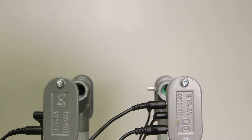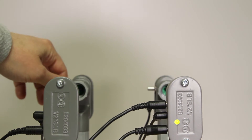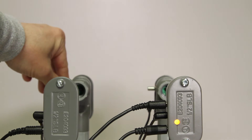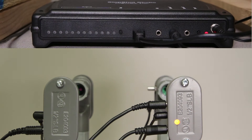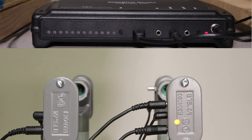Now that we've got those settings in, the first thing we're going to do is turn the transmit power level all the way up. You'll see the light turn green on A, and it's going to turn orange — which is hard to see on camera — but transmit power is all the way up. Now as we swipe our finger through the A sensor, you'll see output 2 come on. And if I swipe it through B, you get the B sensor to come on. And if I swipe it through both, you see A sensor number 2 come on, then B sensor number 3 come on, and finally output 1. Beautiful.